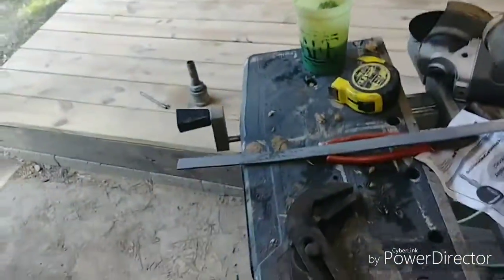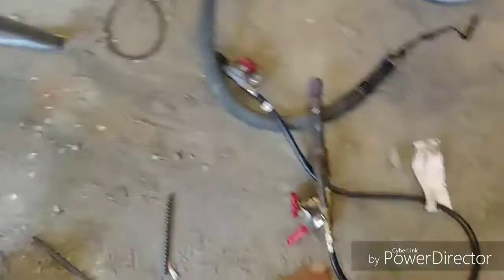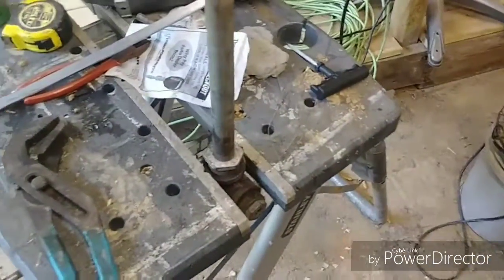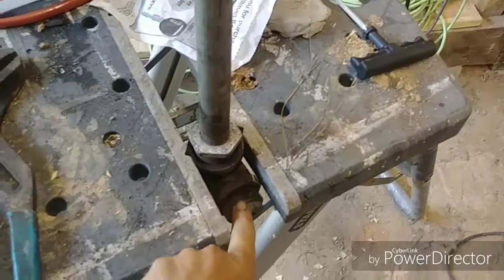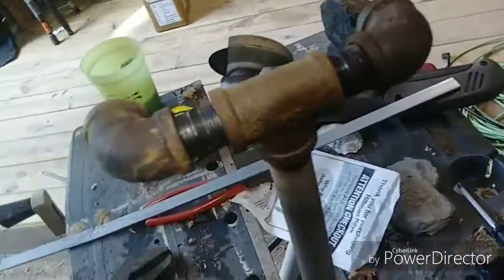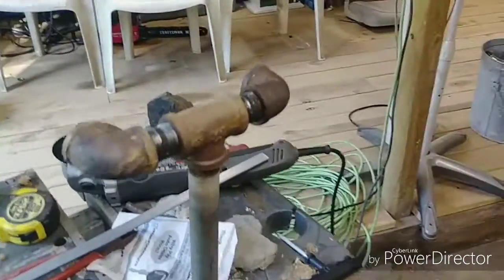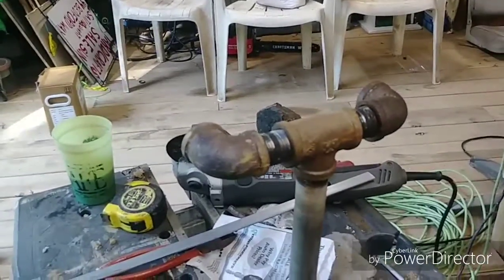I've got a little bit of solder and I've got to get a three-eighths valve. The connection here is three-eighths down to one-eighth — that ought to be a lot of fun. Once I get all that together, all this has to be piped up and doped starting from here on up, because there is gas involved. We don't need any leaks at all — a gas-air mixture that is flammable and under pressure with a flame not far from it is never going to end up good if there's a leak and a spark.